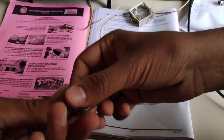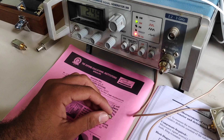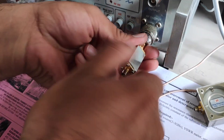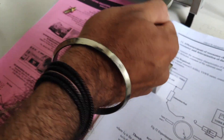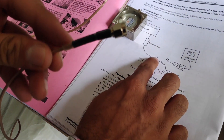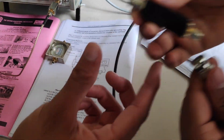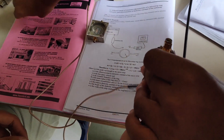For the connections — I will show you here. Attenuator pad, connect this here. With this, connect the cable. This part is known as point P, as shown in the diagram. Now we will go to the VSWR meter. You have to connect it to the input. The other end you have to connect to your detector to get point Q. Since we cannot connect this directly, we are using the connector.